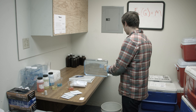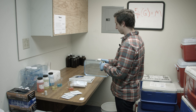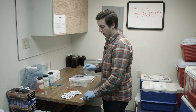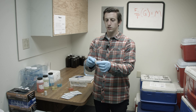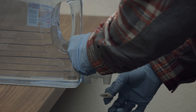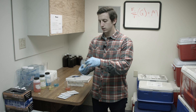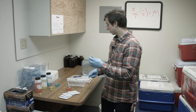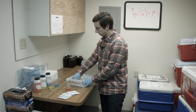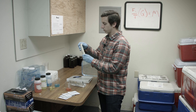Now that I've calibrated this device, I'm going to give it a quick rinse and we're going into storage prep mode. I'll start by turning the device off and getting our rag ready — just a small piece of paper towel. I'm going to fold it in thirds and put a few drops of water on it, spread the water around, fold it up again, and simply stick it down in the bottom of the cap so the electrode will not dry out. This keeps your device healthy and gives it a little more longevity.